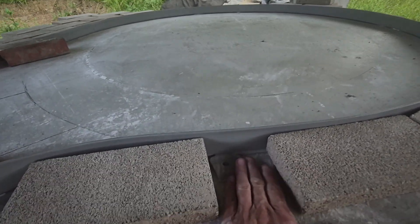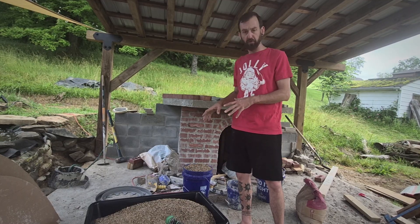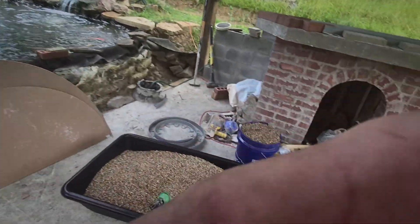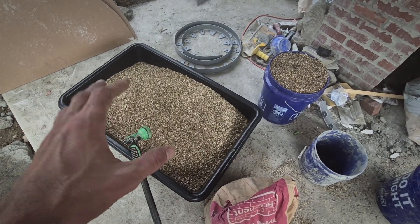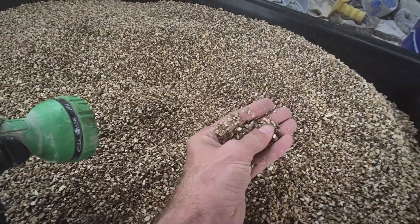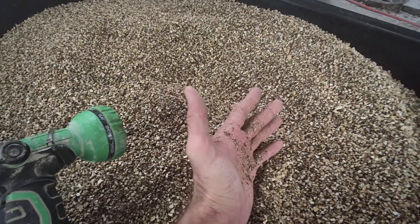That way, if water ever hits this level right here, you've at least got that calcium silicate board and your hearth up. After watching a bunch of videos, when mixing your vermiculite, you're going to want to mix your Portland cement into the dry vermiculite first. If you try and mix the slurry and put it in there, it's a bad idea. Mix it dry, then add a little bit of water at a time — not over-wetting it to where it's soupy. Vermiculite holds a lot of moisture more than perlite. I would recommend using perlite actually, if you can find it — the perlite seems to come in larger balls. You just might want to let it cure a little while before you go building a fire in there, because heat applied to water creates steam and that makes bricks have a really bad day.